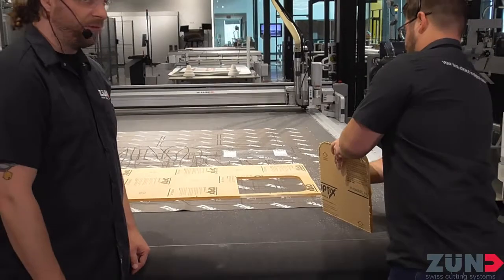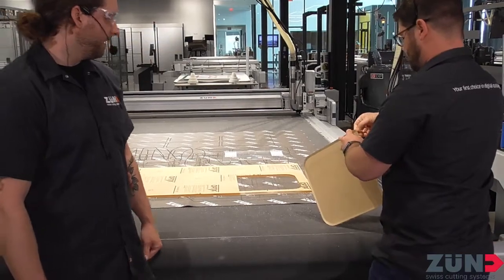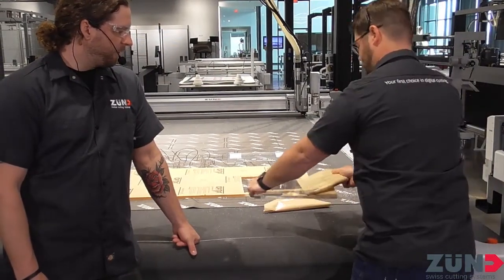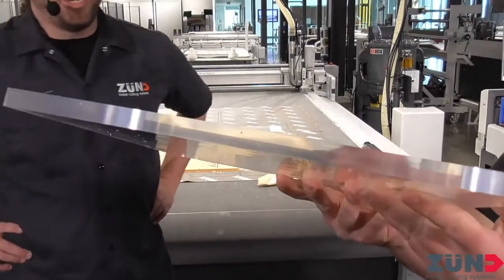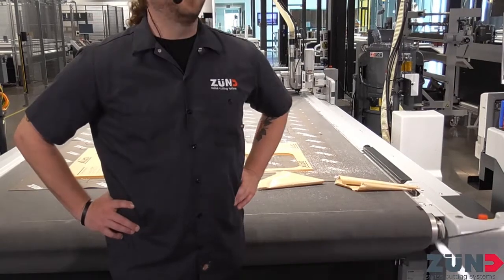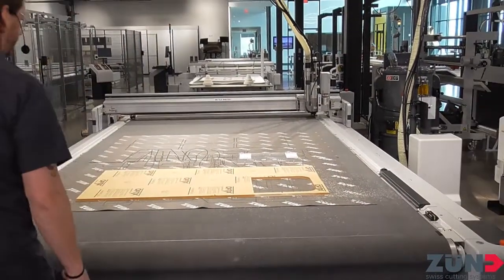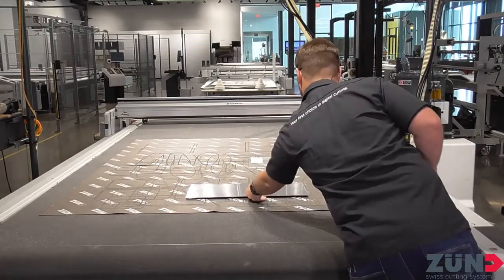It's definitely super nice to be able to resharpen that one. Tearing this film off — you don't have to pre-pull any of this protective paper, it cuts right through that stuff no problem. Anyone who's cut acrylic knows how much of a pain that can be. With our cut editor we applied a polishing path to it to show off that nice polished edge. It does the automatic offset and sets the gap for you. Our cut editor can apply polishing paths, hatch filling, island filling, auto fit, and inlays to these jobs coming through.